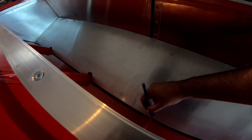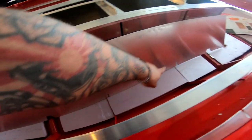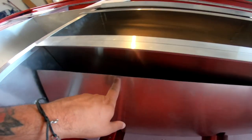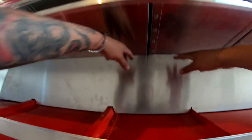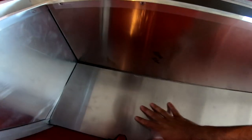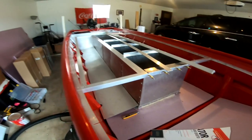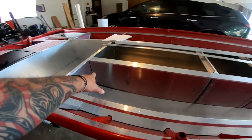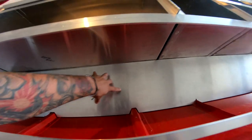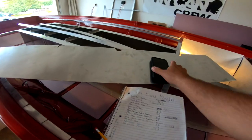How did we do? I'm going to knock off a few edges. I got all the ribs cut on this floor piece — I'm happy with that — and I also cut off five-eighths from the top. Freaking perfect! That is exactly what I wanted — it is sitting on this lip right here. I'm freaking stoked. Now any water that drops off from here hits this, goes down into the crack, runs into the back of the boat. I'm going to cover all this with foam, and even the floor with foam as well. But first I need to weigh this — 2.6 pounds for that one little piece.